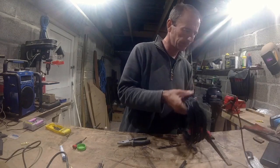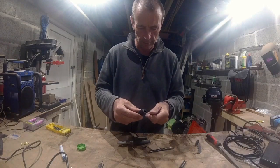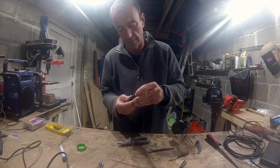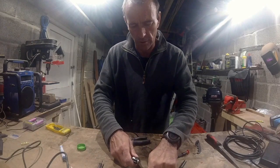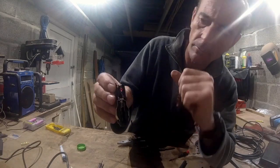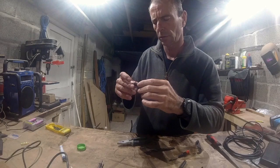All I'm going to do now is put the cigarette lighter socket on the other end. This is a really cool little cigarette socket actually — it's got an LED in it, just a little bonus feature. It's free — I think it might have been off one of those nasty portable fridges. It's got a built-in fuse though, although it's fused with something ridiculous for a single bulb on an anchor light. The centre one obviously is the positive, so I'm just going to trace that centre back through the circuit and make sure I solder positive to positive. It's fairly straightforward.